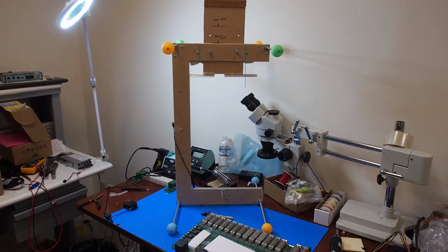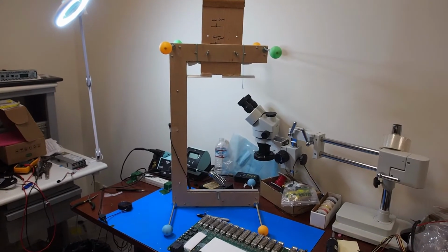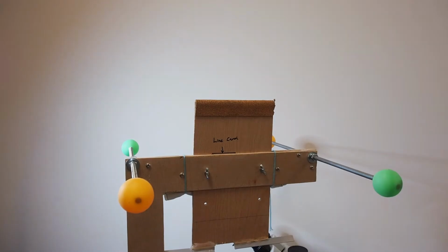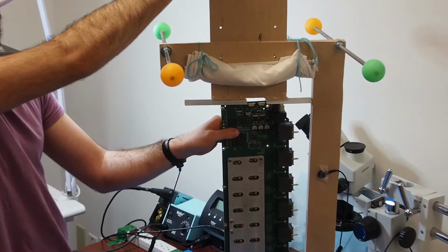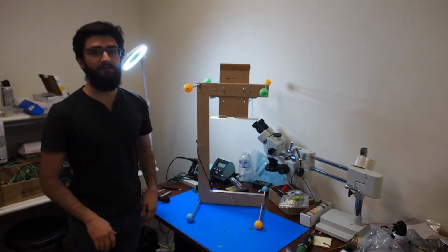Before a PCB can be mounted in the fixture, the sled rack needs to be set to the proper length. There are 2 positions that the adjustable rack can be set to, corresponding to 2 different PCB styles at Lepton: the line card and the fabric card. The gap you can see in the sled accommodates for the components that occur close to the edge of Lepton's fabric card. Now that the rack has been adjusted to the right height, we can now begin the assembly process.